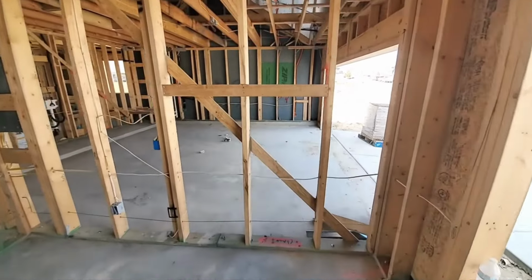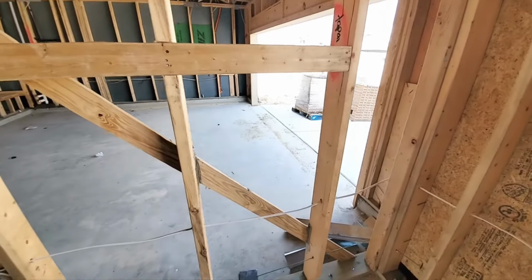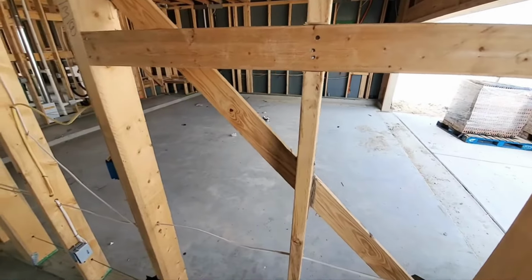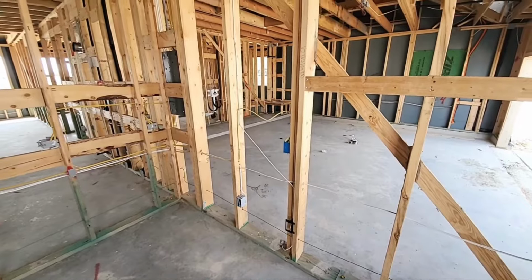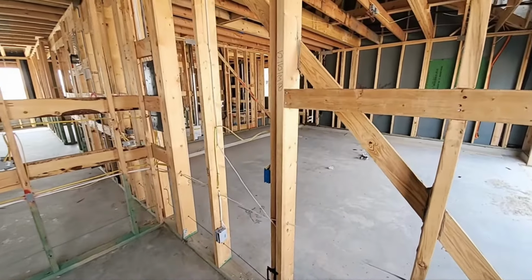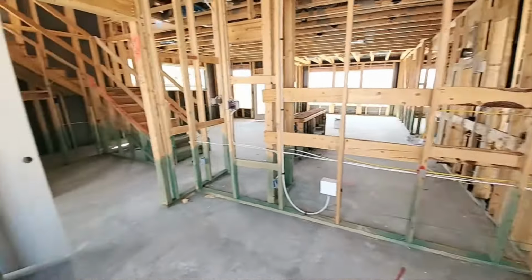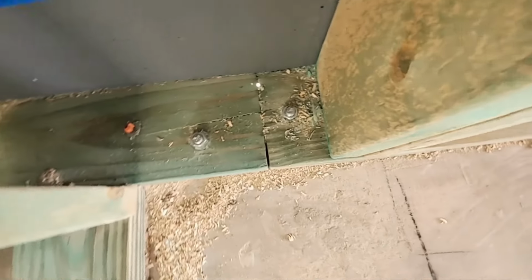One thing I really like to see is that they've got these studs, 2x6s on 24-inch centers. That gives you plenty of space to put insulation. I think that's probably our R19-ish, which is considerably more than the R13 that a standard 2x4 wall would give you. Now, one of the concerns that you had was that some of these anchor bolts